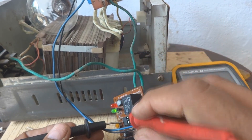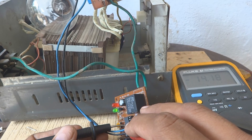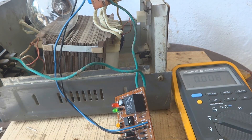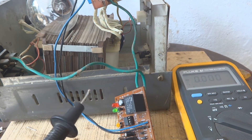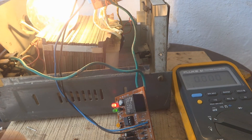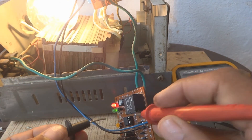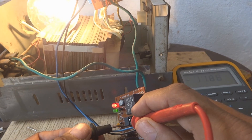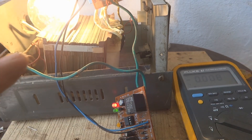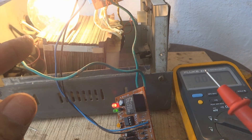You can now see on the meter: 14.17 to 14.18 volts — about 14 volts — which is acceptable. When the relay switches on, there will be more voltage drop across the resistor and the voltage will reduce further. After completing the timing, the relay switched on — the lamp is now glowing. Checking the voltage again: 11.88 volts — approximately 12 volts — the circuit is operating perfectly.